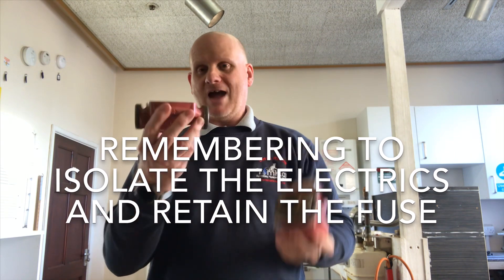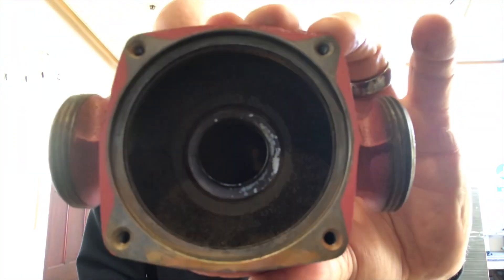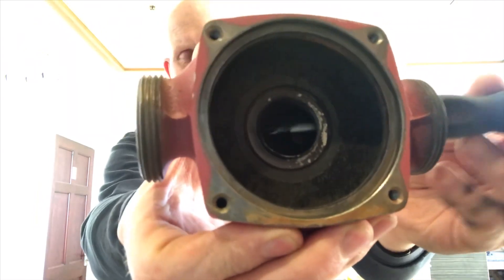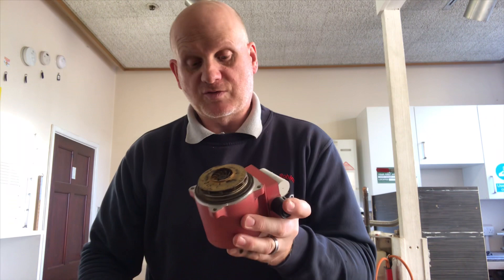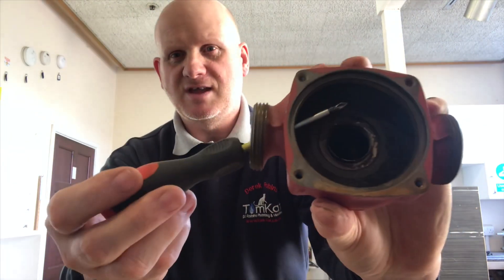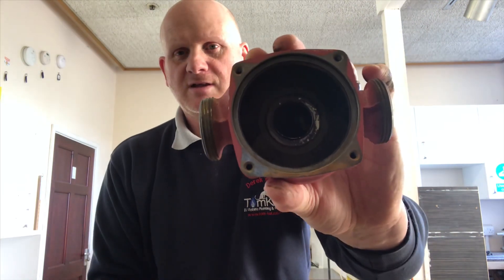So how does this work? This is our inlet — this is where the water comes in. The water is pumped out through the middle. If you look on the inside you can see the hole in the middle where the water comes through, then it goes through the centre and is flung out by the impeller. This is a centrifugal force pump — it spins and the water comes out through there — and that's how it pumps it around the system.